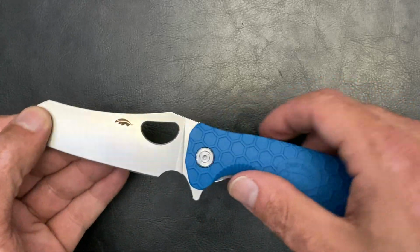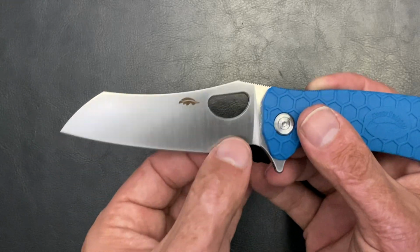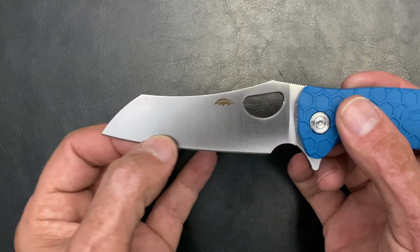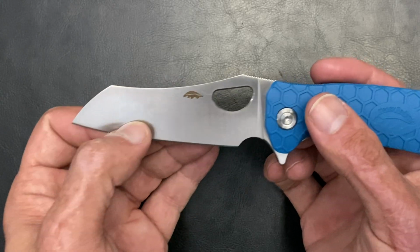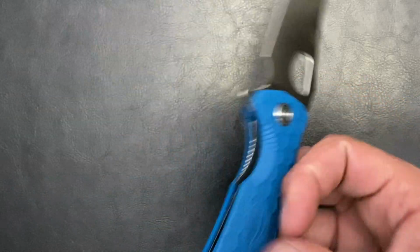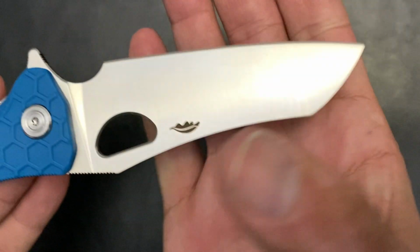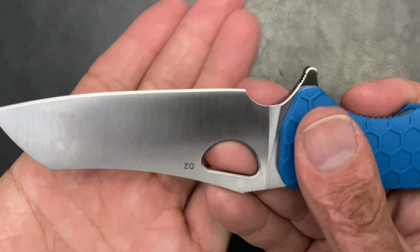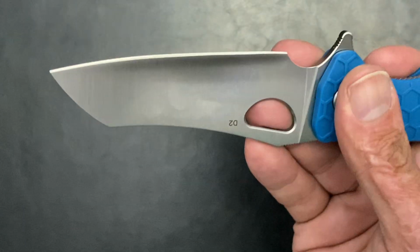Your behind the edge thickness varies. At the thinnest portion, it is 15 thousandths right here in the back. Nice and thin right here. It gradually tapers up some, and at the thickest is 20 thousandths. So I'm perfectly good with that. And my variant is sharpened at 20 degrees per side, fairly even on both sides. Maybe just a tad bit broader on this side.